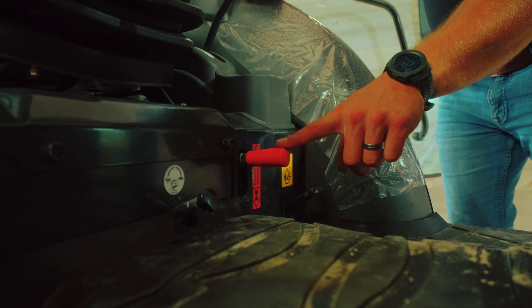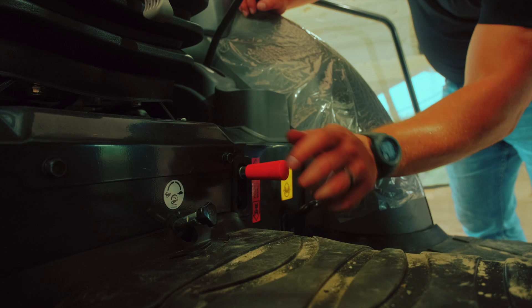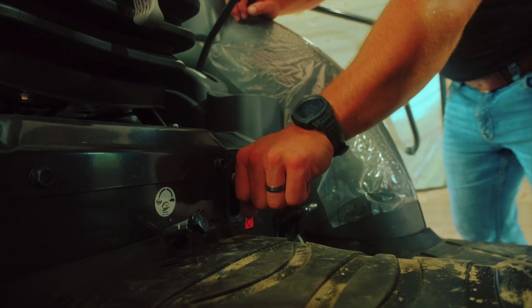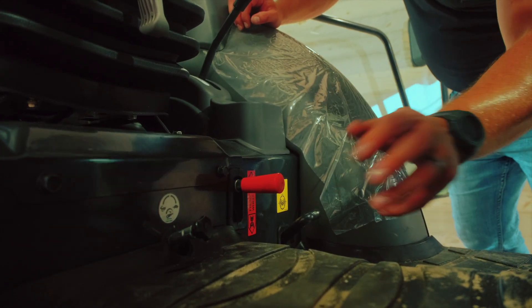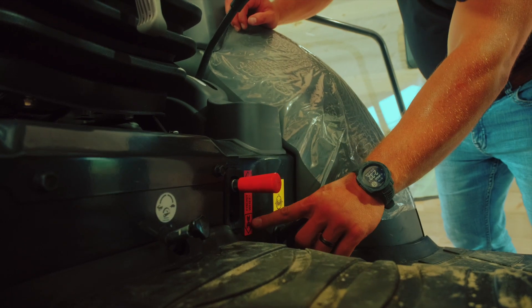This over here is our front wheel drive, four-wheel drive. If it's up, it's disconnected; if it's down, it'll be engaged. If you push down on it and it doesn't seem like it wants to go in, a helpful hint is to push the transmission pedal forward just a little bit — that'll help it slide into the four-wheel drive position.